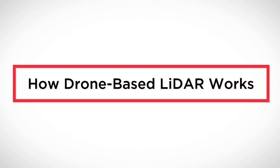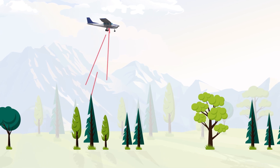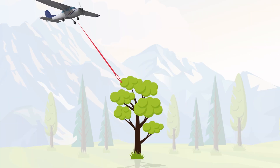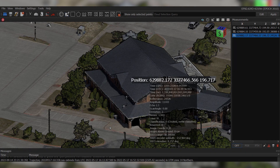Let's start with how drone-based LiDAR works to generate an accurate 3D point cloud. In our previous video, "What is LiDAR?", we covered the purpose of LiDAR, how it works, and what it does, so jump back to that video for more details. As a refresher, a LiDAR system emits hundreds of thousands of pulses of light that travel to the ground and back every second. When a pulse of light bounces off an object (a target) and returns to the LiDAR sensor, the precise location of the target is recorded by the system (a return), with an XYZ position generally accurate to a couple of centimeters.